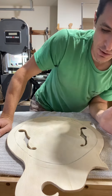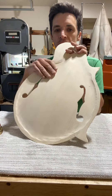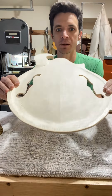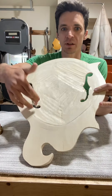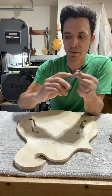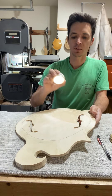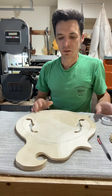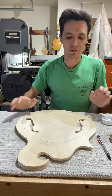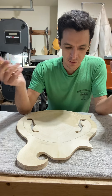So this is just a demonstration of how I go about bringing that thickness down. I'm going to leave the outside profile alone — that's pretty close, and sanding can coax the final shape out. It's really the inside — you can see I've been working in a diamond pattern. The things I use at this point are just this hand plane, mechanical pencil, and this little light that I press on and use to cast different shadows as I orbit around the piece. I also have this thickness caliper. I'm just going to start carving so you can see the process and flow I approach this task with.